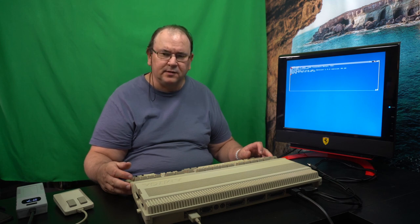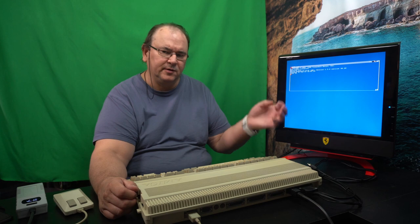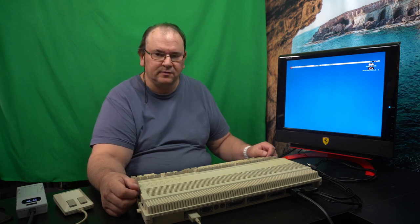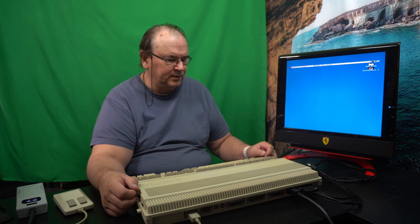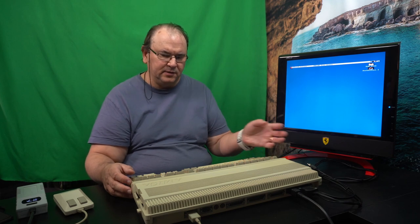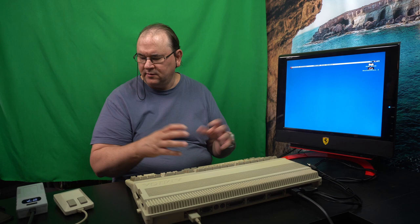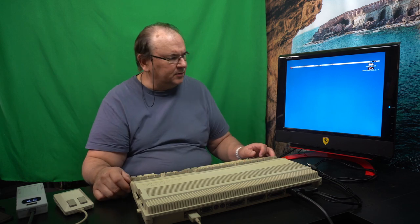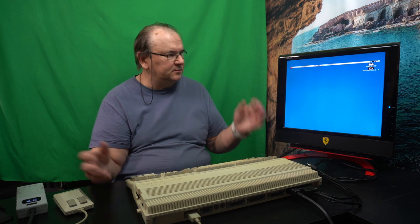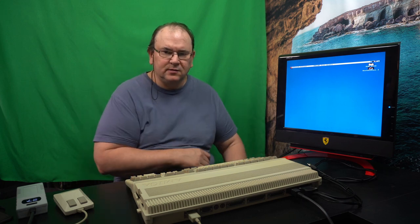It was very strange that I couldn't get it to work within its shielding. Even when I added, a little bit off camera, a seemingly ridiculous amount of extra insulation tape and stuff, it was still just basically mechanically failing. When you inserted it upside down, usually then it worked. And then when you put the cover on, then usually it failed either there or when I turned it around this way around, then it would randomly fail. But when I run the card separate, then I get no random failures whatsoever.